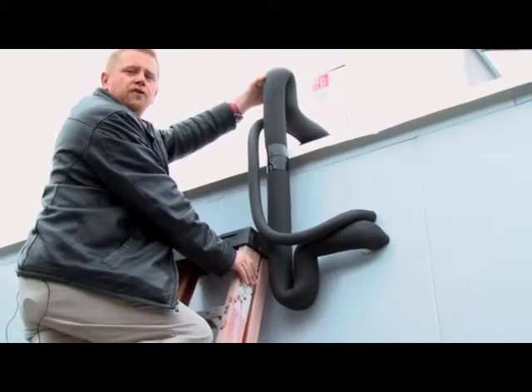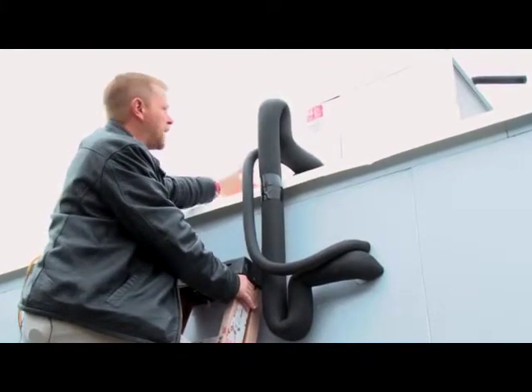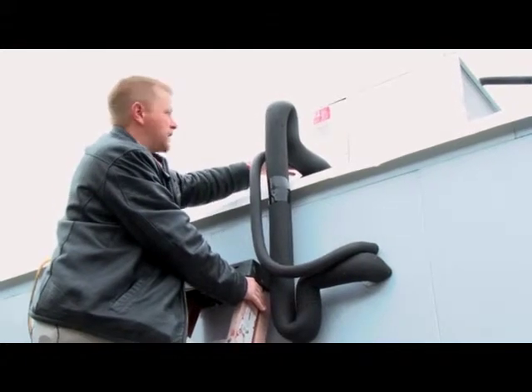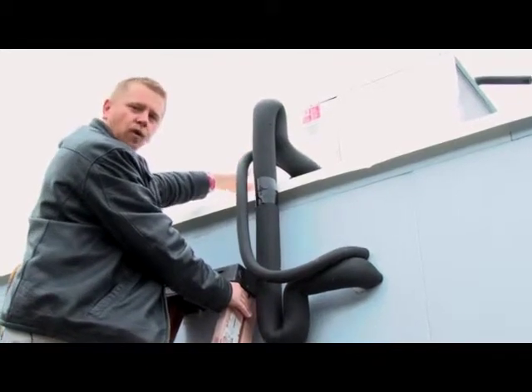Once you get to the roof, you should then put an inverted trap. This will alleviate the possibility of the oil being able to drain back down once it actually breaks the rooftop. Once you pass the inverted trap, the remainder of the suction line should slope back toward the compressor.